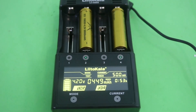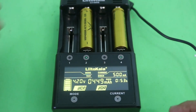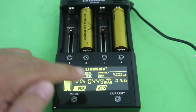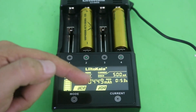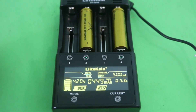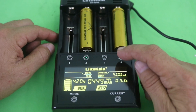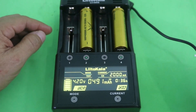The process is finished. You can see that the lights are green, and that indicates that the batteries have been tested. The first one, in bay number 2, indicates 449 mAh in discharge and 479 mAh in charge. The two figures are always very similar. Of course, it is much, much less than the 8800 mAh that the battery claims. And the other battery in bay 4 indicates 498 mAh and 491 mAh.